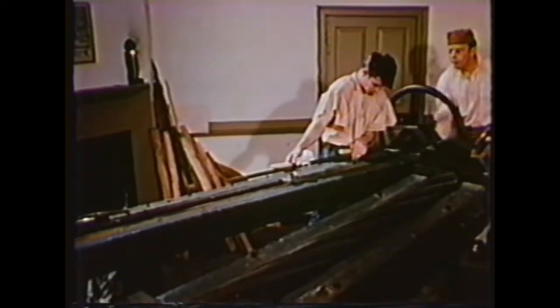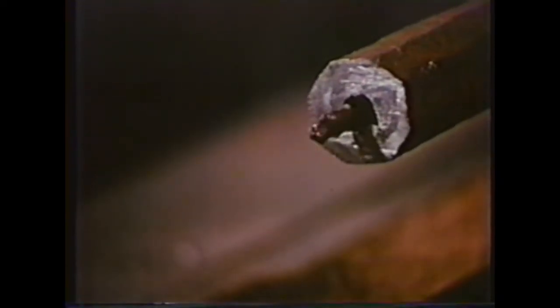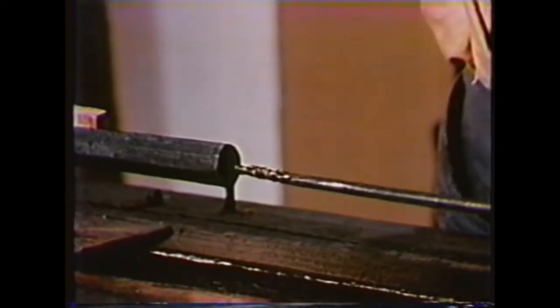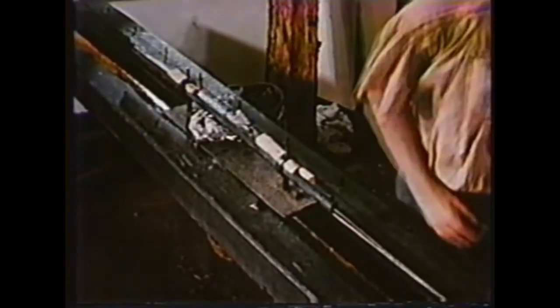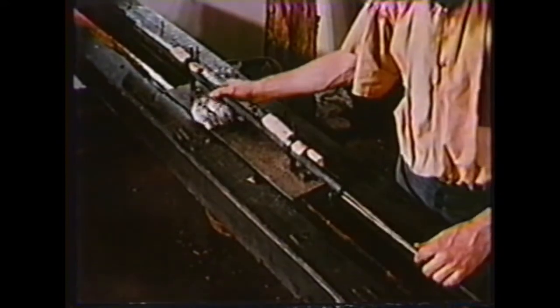The first boring bit does not cut from end to end. It just hits the high spots in the barrel here and there, so I push this through by hand. Each new bit is a little larger in diameter and longer in cutting surface than the one before. We use about twelve to fifteen rough bits. Once we get a bit cutting the whole length of the barrel we drive it with the chain and weight. The gravity feed is ideal for this type of work because it will slow up at the hard spots. If the barrel advanced at a constant speed it would break a lot of bits.